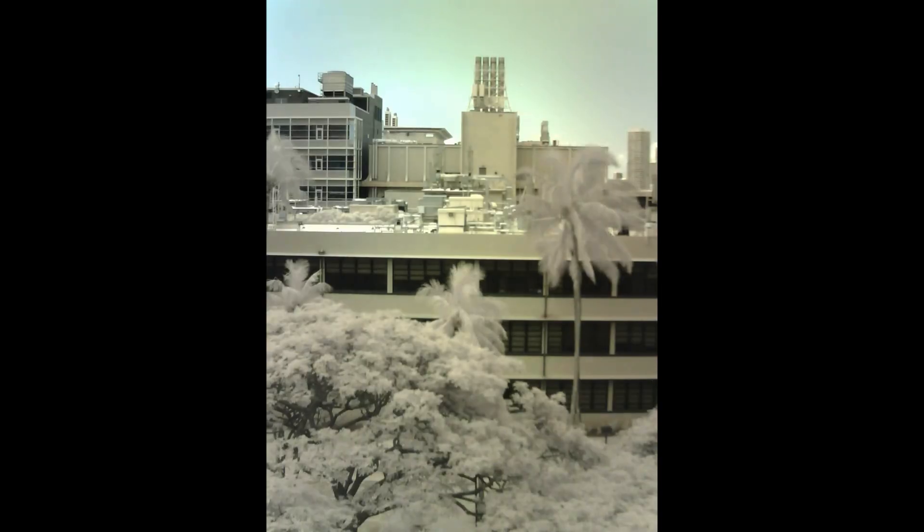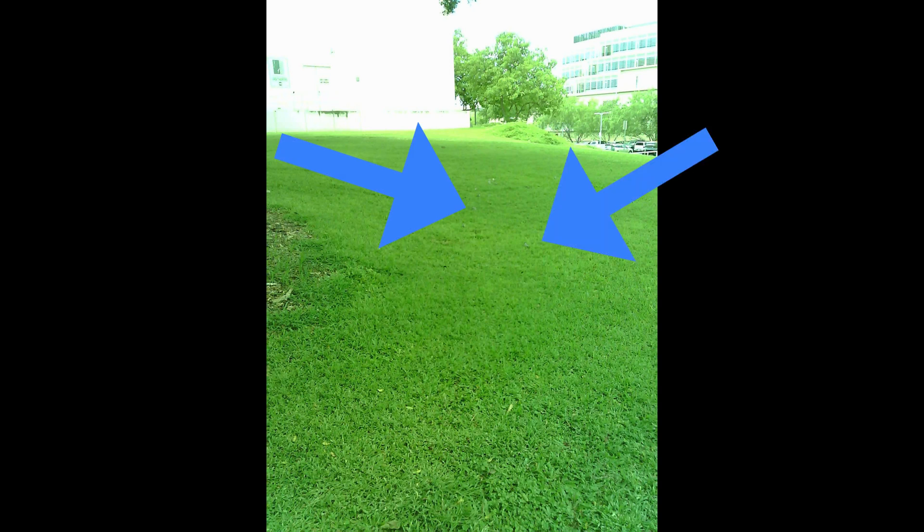You can actually make your ESP32-cam see infrared really easily. I bought a 6-millimeter lens off Amazon, and I did not know that on an ESP32-cam board the infrared filter is inside the lens itself — it's not anything on top of the sensor. So when I took off the original lens and put on that new 6-millimeter lens with my adapter board, all of a sudden all the photos I was taking were capturing infrared. Water, which absorbs infrared light very readily and reflects very little of it, appears really dark in photos — I'll show you right here of Manoa Stream. Also, when you're trying to pick out animals from complex backgrounds, like this photo of some tiny finches — three or four inches long, down in the grass — all of a sudden when you switch to an infrared lens those finches stand out right up from the background. They're super easy to observe.